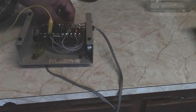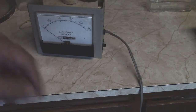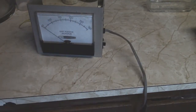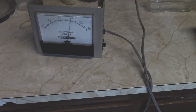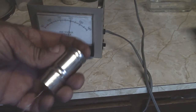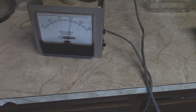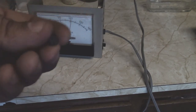It was applying too much current to that zener diode — the diode was overheating and getting grumpy. I replaced it, just stuck a 10k resistor in there. It doesn't have to be real specific; all the precision resistors are elsewhere. This is just a reference, and now it seems to work just fine. So basically, in a nutshell, he had three problems: a blown fuse, a capacitor leaking badly, and a resistor horribly out of tolerance. The leaky cap probably blew the fuse. The resistor may have just been a crummy carbon comp that drifted over time.